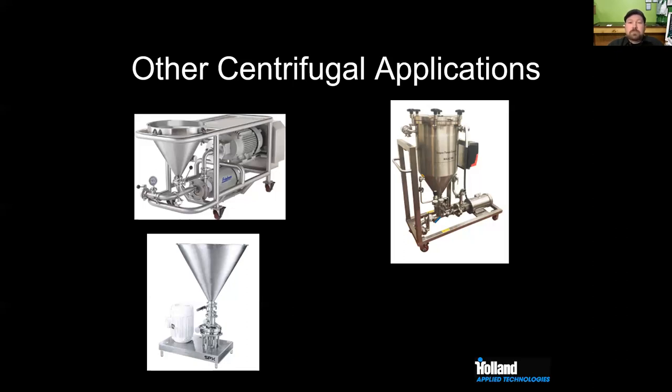But if you're running for a prolonged period of time with no flow or very low flow, then there's a very high likelihood that you're going to toast that seal, and it becomes very obvious when you look at it. I can't tell you how many times, and I'm sure James, you've seen the same thing when you're doing these brewery startups. You'll ask them, did you run it dry? And they'll say, oh no, absolutely not. And then you'll go out and look at the seal, and sure enough, the thing is ground almost flat, and there's no sealing face left.